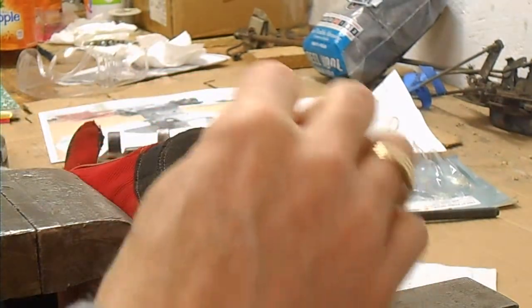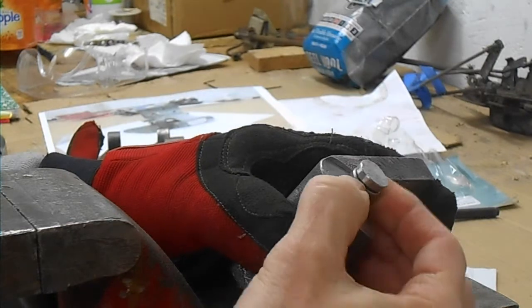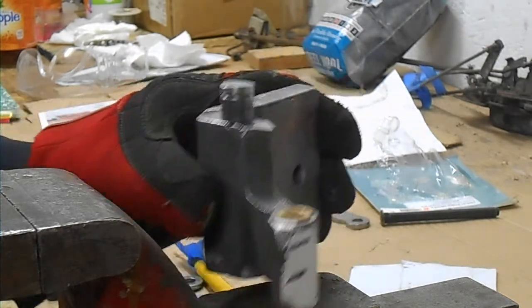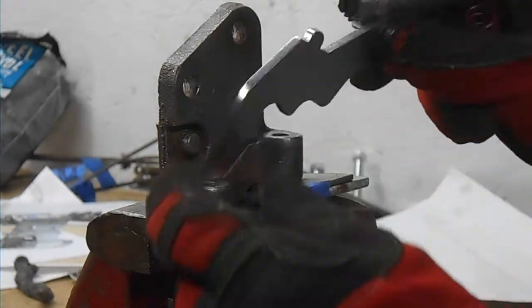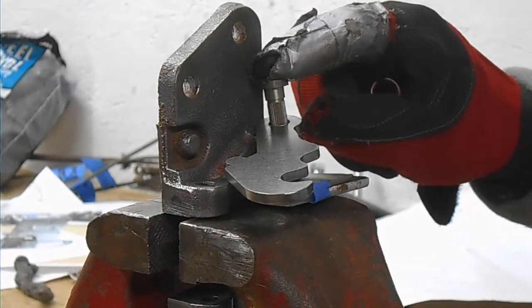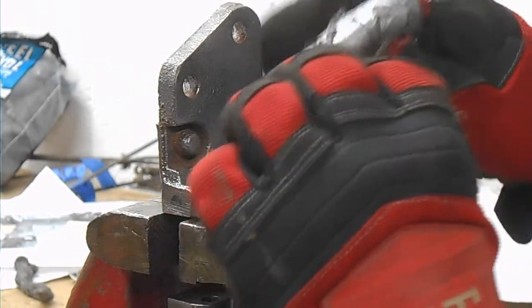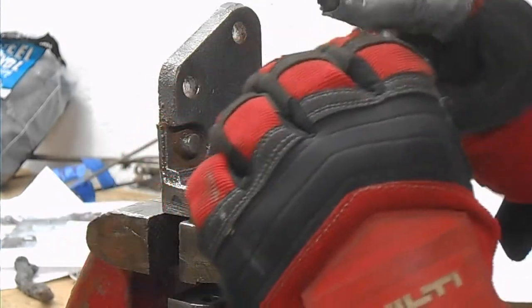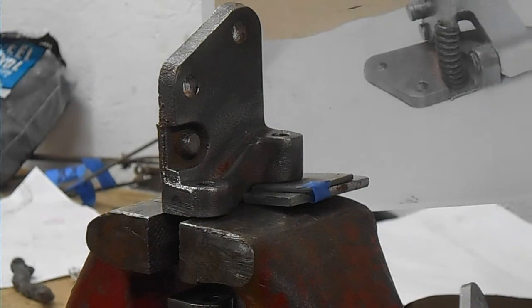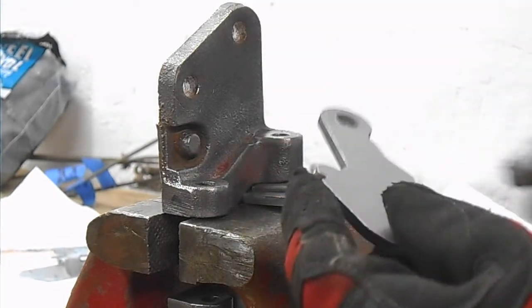The pin is in, and this little bushing rolls freely instead of getting stuck like the old one did. I can't hammer it any more because of that little ledge on the bottom — that's how it's intended to be. For the next step, I'm going to put in the detent arm. Its pin goes in this hole, and one thing to be careful about is that you don't put the detent arm in backwards. I'm working from a picture I printed out so I know what I'm doing.